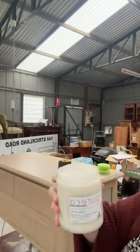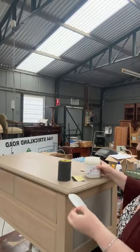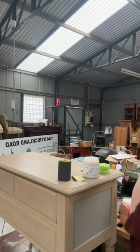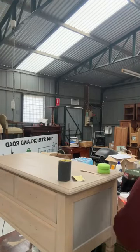I've got one of each size still on the shelf — I'm taking one off myself because I've been using it a lot. Always wipe your lid off very, very carefully. Now, it's white — like a creamy white in the jar — but it does go on clear. Before we put the second coat on, I give it a really light sand and then wipe it over with a tack cloth. I've been using tack cloths lately, which I love. I've tried a few different brands because I'm looking at stocking them. It's like a sticky cloth and it picks up all that dust.